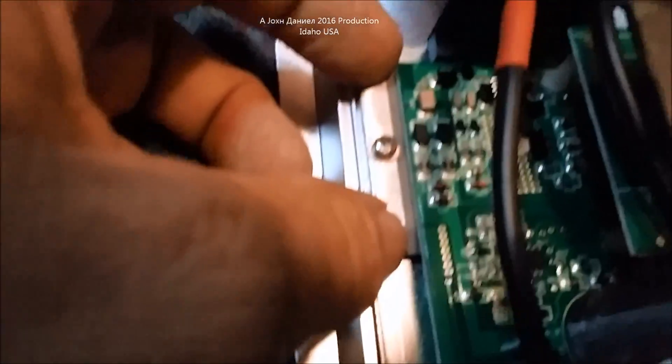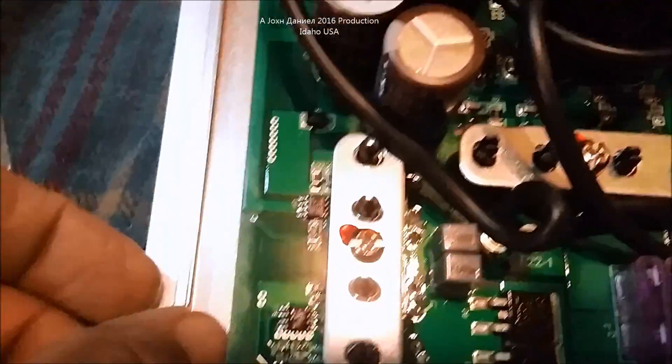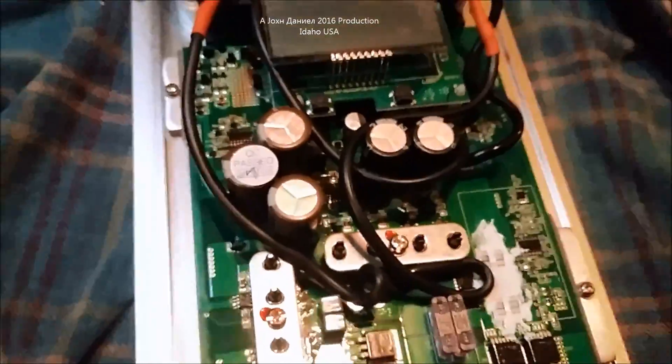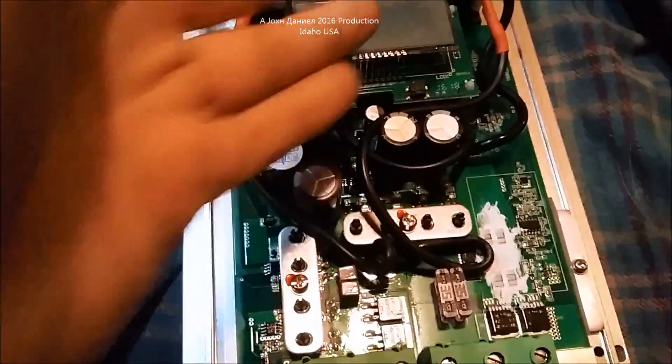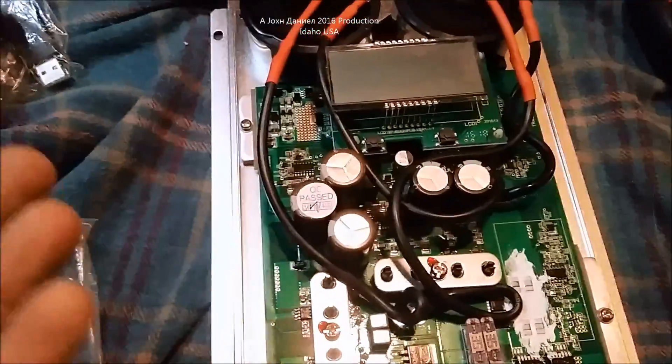The structure of this is actually quite significant — it has a very large heat sink and underneath you have your MOSFETs in a row. There are four MOSFETs down there, and four more underneath the other section, for your two different sets of circuits. So this is truly like a pair of 20-amp controllers, and with this circuit right here it allows the combination of them — and from what I understand, it does a very good job.